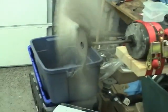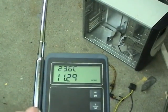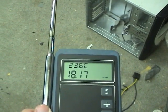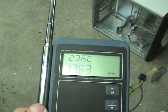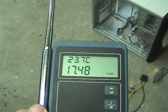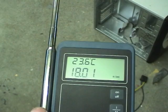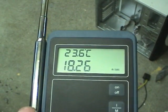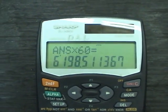Let's take a look at the airspeed. The airflow is about the same speed on this one as on the bigger fan — about 18 meters per second. And that results in a calculated CFM of about 6,200.